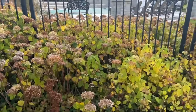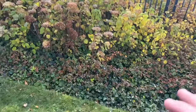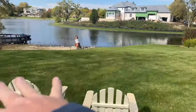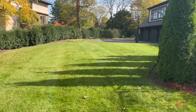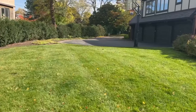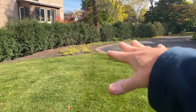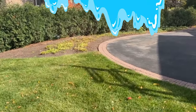Don't even worry about taking these plants out, just drive right over them or put plywood over them. The other important thing, you gotta hug this bush line here. There's all septic out in here, so we can't stay out in there. You can see the drive right there. Feels like 12 sheets, 15 sheets for the machine. And then as our rock and gravel comes, we're just gonna put some sheets out over here. I don't know, bring 30, bring them all. We'll just put a big pad down and all the rock and stuff can stay here.